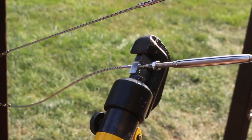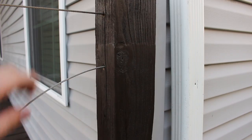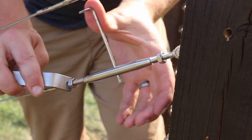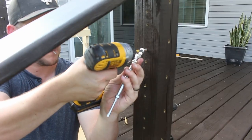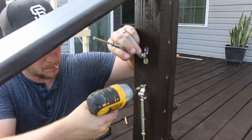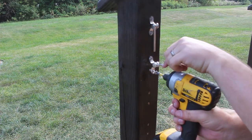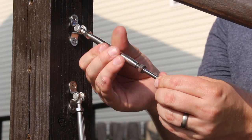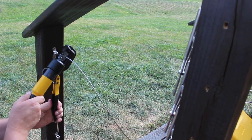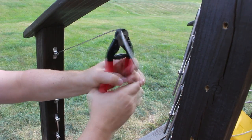With all the wire ran, then comes the tricky part. You've got to use your crimper to crimp your wire to your turnbuckle, and then on the other side I used these static stops bolted to the post to hold the wire in place. To get a nice, taut line, all you have to do is tighten down your turnbuckle and you're ready to go. The stairs are a little more tricky — being at an angle, our wire has to be at an angle, so we need some pivoting turnbuckles and stops to accommodate for this. Before crimping your wire to your turnbuckle, it's super important to extend it out as far as it can go so you have tons of flexibility when tightening down the wire. Just crimp your wire at one end, cut it to length, and then crimp it onto the turnbuckle as well.